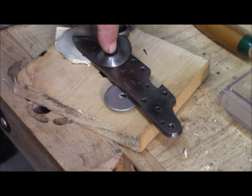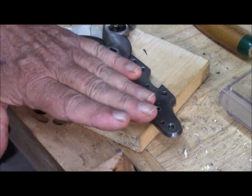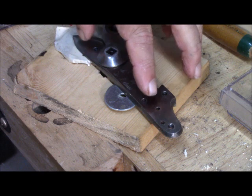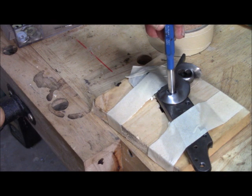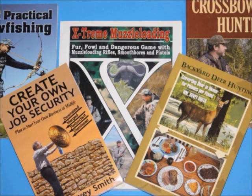Prior to applying pressure to this part, I'm using metal washers and wrapping with masking tape to support the lock plate on a more nearly level field, so my push with a punch will be straight down instead of at an angle. This is to relieve pressure on the lock plate itself and give a more directed push. I've selected a punch that fits inside this rectangular area and goes from edge to edge with very little movement, so this will give me a good straight-down push when I apply vertical pressure. I have one press that has enough throw to put this punch in at full length without having to cut or trim it.